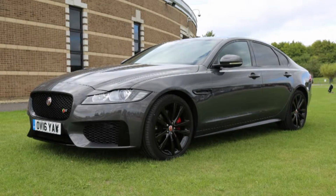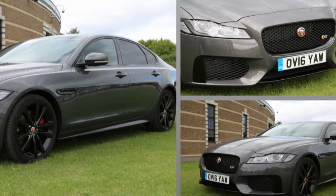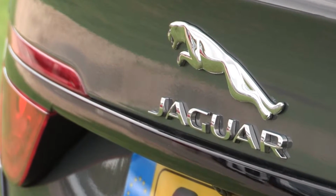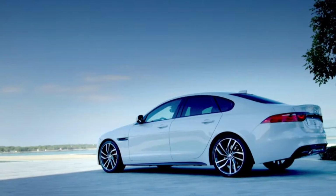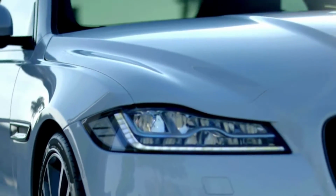Another product form that I can't show on the car because there's no direct visual reference, but which is actually used in the structure, is extruded components, and it's a different process to casting and rolling. In extruding, the metal aluminium billet is actually forced through a die to create a continuous section. That finds its way into certain applications on a vehicle, for example bumper beams. Typically that's an area where extruded aluminium sections are used.